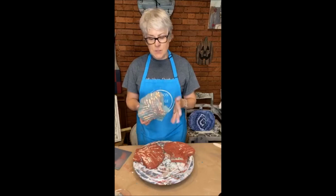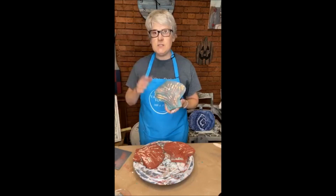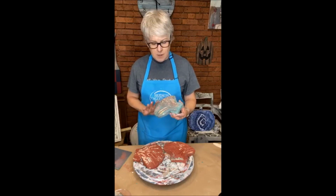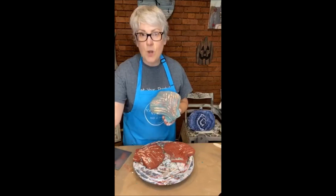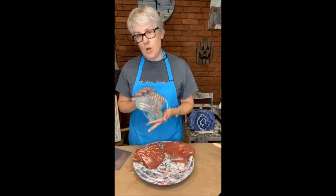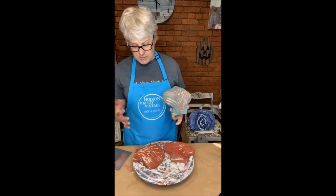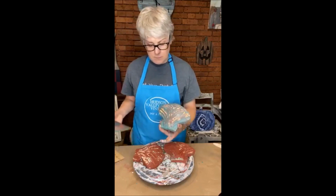If you're doing this on a piece of furniture, it has to be the right piece. So you want to use a piece that you want more of a primitive look for. You wouldn't use this on a modern piece or a mid-century modern piece. But on like a farmhouse table or a farmhouse dresser, imagine this on an old step stool, or better yet, if you have a new step stool that you want to make look old. Oh my God. So that's what the layering colors is about. You're basically going to paint it one color, let it dry, and then do 1 or 2 coats of your top color. You want the colors to be contrasting, and then you're going to let the last color dry, and then just take some sandpaper and go to town with it.